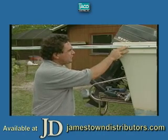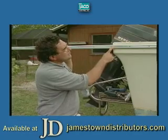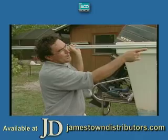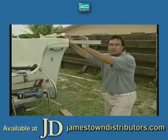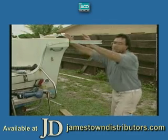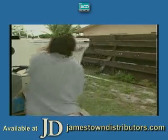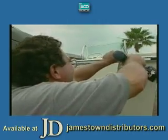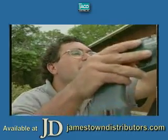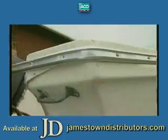I'm down to my final length of rail where I need to turn around this back corner, and I've got a screw that's going to wind up right in the middle of where we're going to make our bend. To eliminate any possible future weak points, I'm going to slide this forward and bend between the two screws, and I'm going to mark it where it butts up and then cut this length in a miter box. Now that we've cut the length so we don't have a screw hole right at our bend, I've installed another piece of insert right at the turn so we can bend this around the corner. We'll put a screw in here to hold it in place, then go back and pull out that small piece of insert and install the screw underneath it.